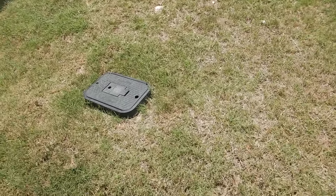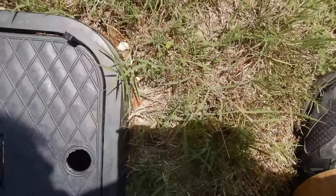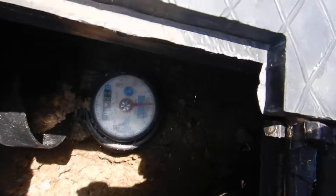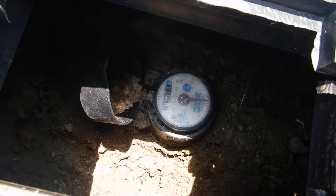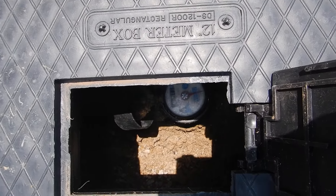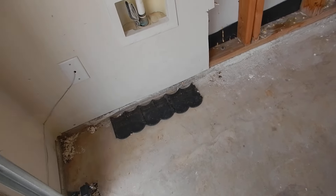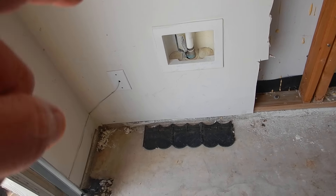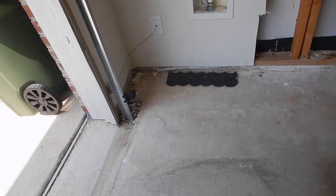Here on the north side of the driveway is the water meter. If you look inside, there's a little silver sprocket — that's a flow indicator. Some people call it a cheater wheel or cheater pin; it's very sensitive, so if somebody were to wash their hands right now it would spin like crazy. Past the water meter, beside this wall, is the main water shutoff valve. We do not have a pressure regulator here — it's just a normal water shutoff valve.